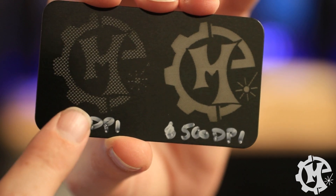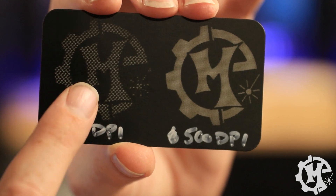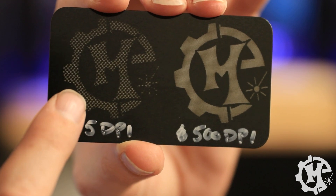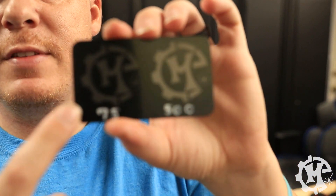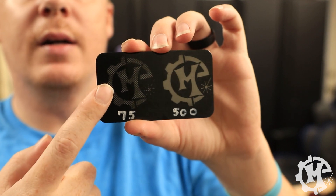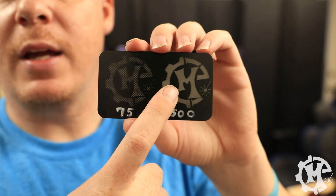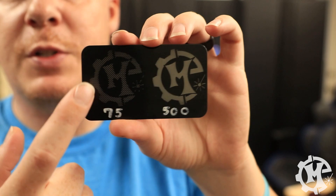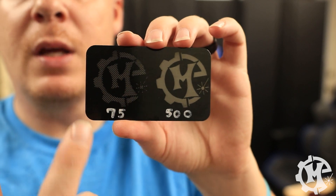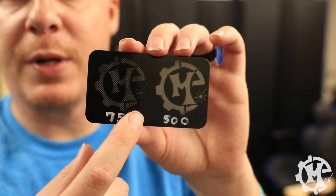Keep in mind this is also set to the color green when I machined it, so black or blue may have a different DPI look. The 75 DPI one took about 15 seconds, maybe a little bit less. The 500 DPI one took over a minute. Just by adjusting your DPI, this will change your machine time pretty drastically, especially if the design is much bigger.